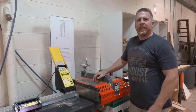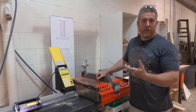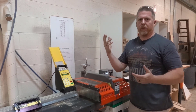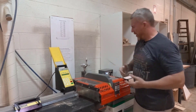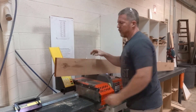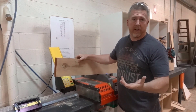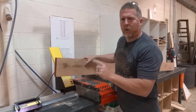Step one in cutting the legs is we first need to make a rough cut out of what's called six-quarter material. Make sure you've got the right material, whether it's alder or walnut or oak or whatever, so you're pulling the right wood. I'm happy to check it if you're not sure. First thing to check is when you pull it out, you'll notice that six-quarter lumber is actually about an inch and a half thick — much thicker than our normal stock that we use for our other projects.